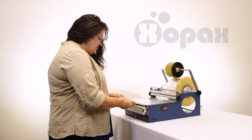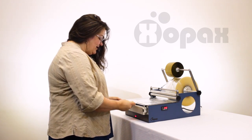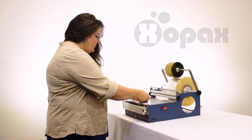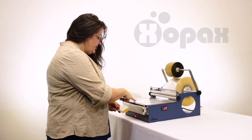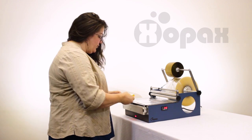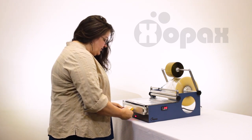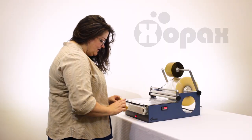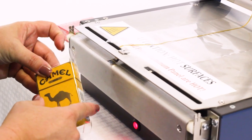A tendency is to put a lot of focus on the wire when you're doing this, because the wire is hot and that's what actually cuts the film away from the roll. But the problem is if we're focusing too much on the wire, we're not doing it in a smooth motion. So we're going to bring it across, make sure the tape is centered in the fork, and just ignore the wire and tap here and press. And you can see when I do that, it gives us this nice clean seal.